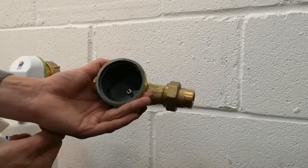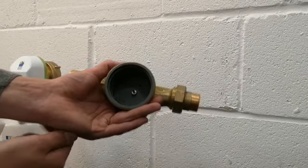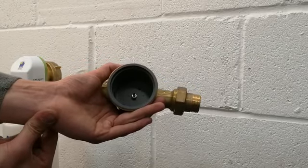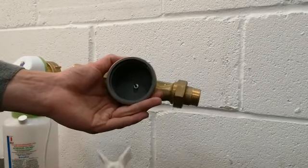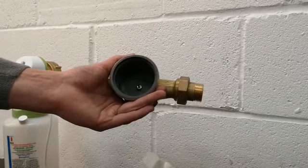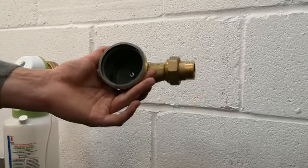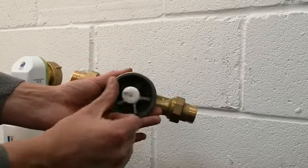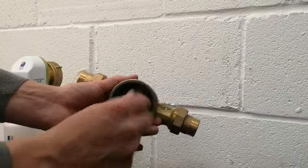We have found PTFE tape, joint sealant, different compounds in the system, which can obstruct the impeller from rotating and can block the system. So in order to fix it, we can remove all the obstructing objects and slide back the impeller to make sure that it moves freely.